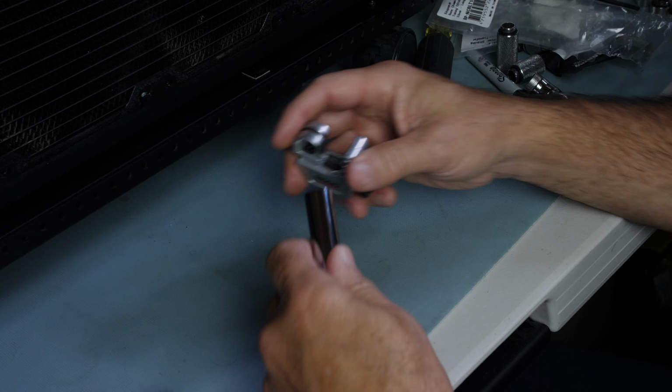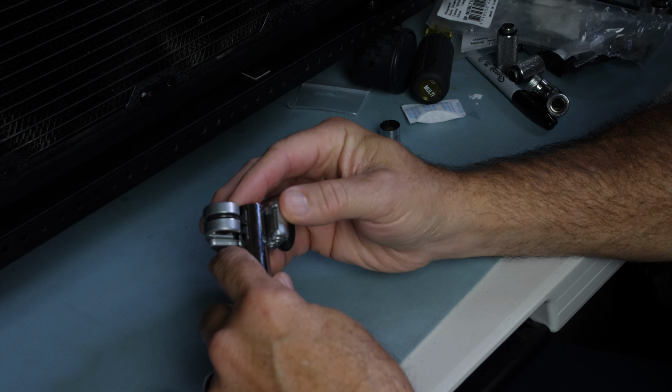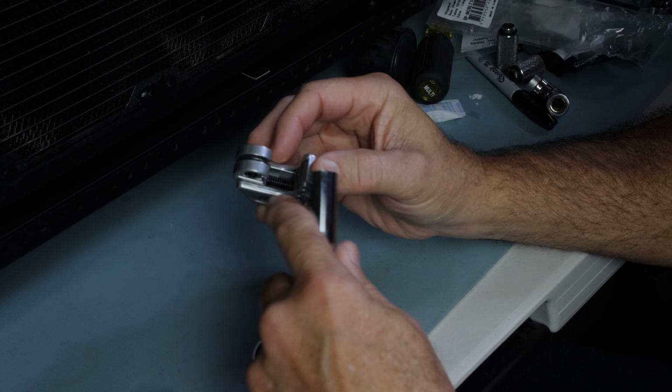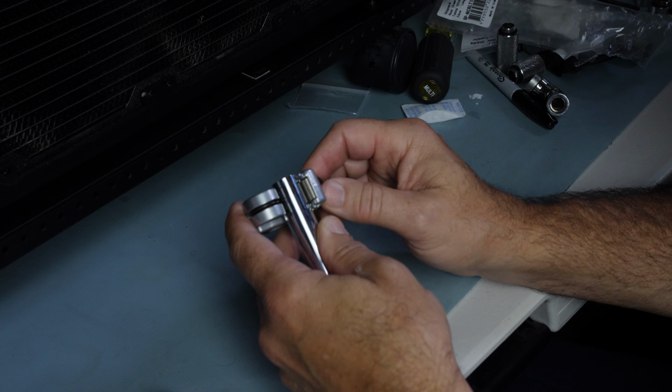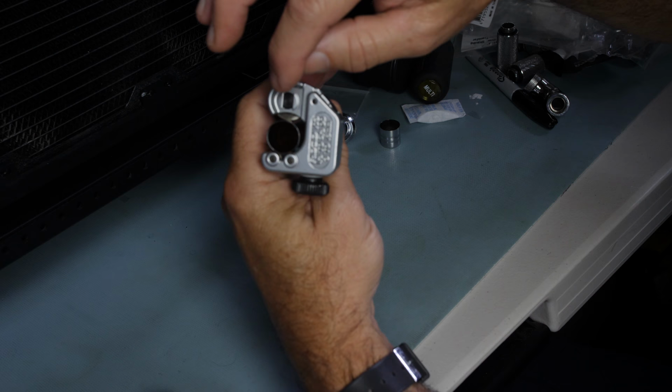And what you've got to do here is you open up your wheel and you put the pipe in the device. And for the shortest cut, I like to have some of it resting right here, because I think maybe it wobbles and it won't get the wheel cutting in the same spot. So at a minimum, you're going to lose some on the edge of your tubes. So what I do is I put it on, I get it in the groove. It'll sit right inside of this groove right here, and the wheel comes down on it. And then I try to rotate it the same way. I don't put too much pressure on it.